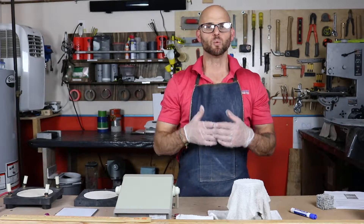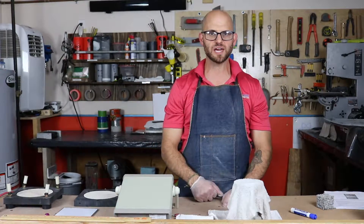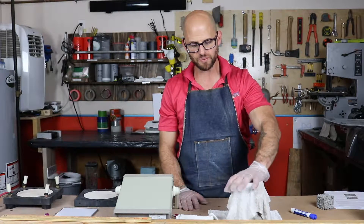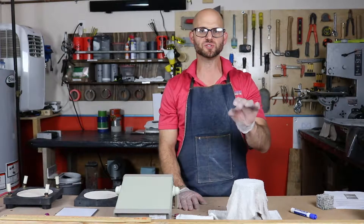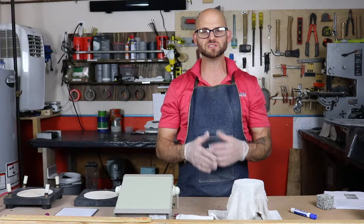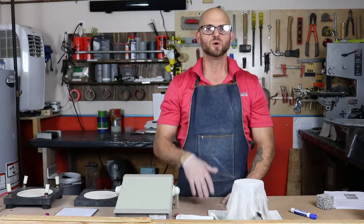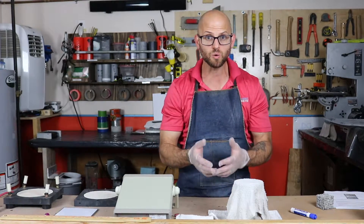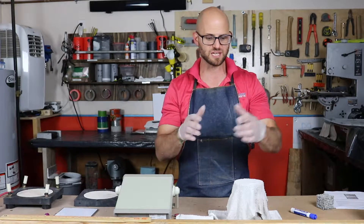What is bulk electrical resistivity and why the heck do we care? Bulk electrical resistivity is a measurement that we take from a concrete sample where we're looking at an electrical signal going through our concrete. Based on the concrete mix design or the materials being used, we get a certain resistance to current flow, and that's what we're measuring in ohms.